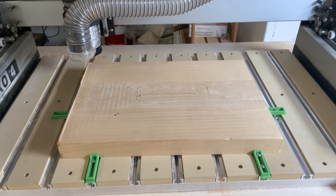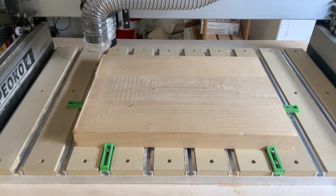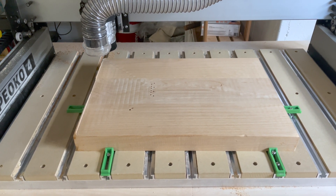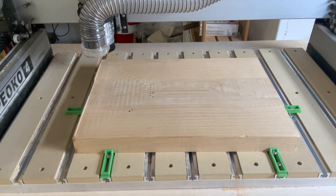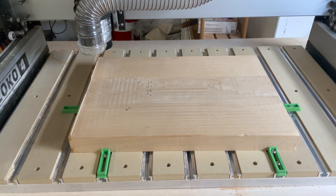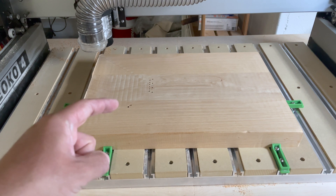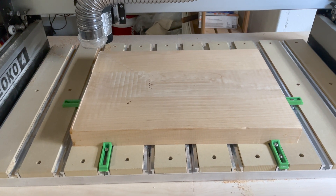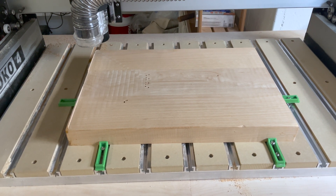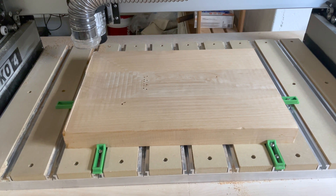The important thing to understand is that unless you change it, the CNC machine will have the same zero point — both the X and Y axes — as well as the same Z, which is up and down. My body blank is now thinner, so I'll recalibrate the machine to have a different Z zero point. But because I kept the X and Y points the same as when I was doing the guitar body, I can go back and restart my job. All of these holes for the strings, the electronics cavity, and the neck pocket should still be in the exact right place. This is one of the good things about CNC machines — as I get better at this, I hope not to continue making mistakes like this, but it's awesome that you can program the computer to fix things.